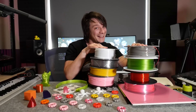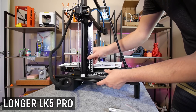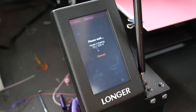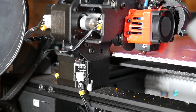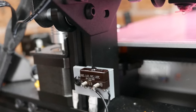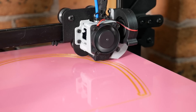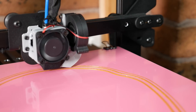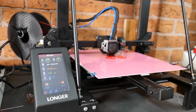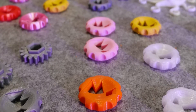I did a lot of testing. For my testing I chose the Longer LK5 Pro, which I reviewed some time ago - a larger i3-style printer with a fairly decent interface and decent features. I modified the homing switch from a V-roller to a much more precise Z switch, which is really critical for getting a good first layer. I also printed a custom cooling duct with a bigger squirrel cage fan. It's still Bowden, and I've been printing everything out of PrusaSlicer with Ender 3 style defaults, getting really quite good results.